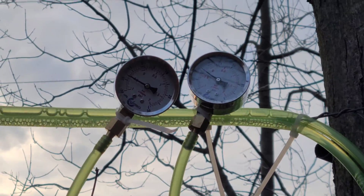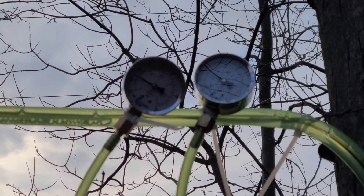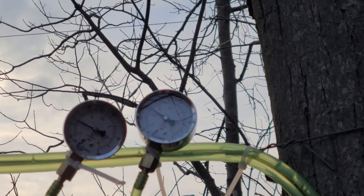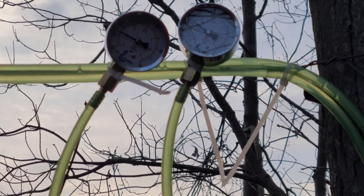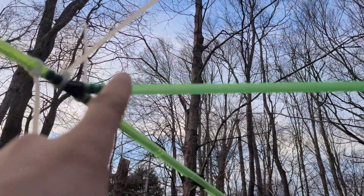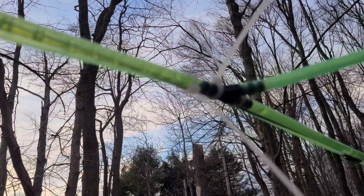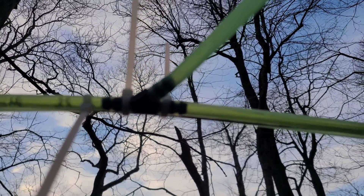Get her tight and see what we can end up pulling with it. It's been a few days — I've been looking for a leak and can't find it, so we're back to looking. I just came up from the pump and you can see the one on the left is the same pressure as the pump — that's my top run. The one I've been looking for the leak on is on the right, sitting at about eight inches compared to the left which is about 16 inches. This is my first lateral on this bottom run — you can see there's nothing sitting in it.